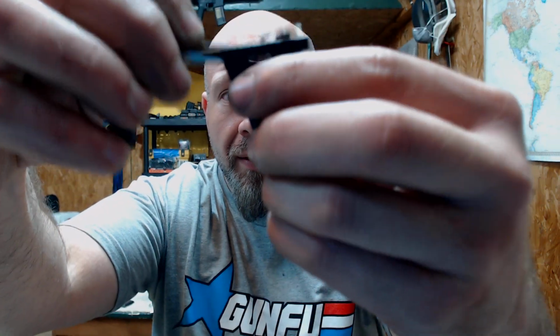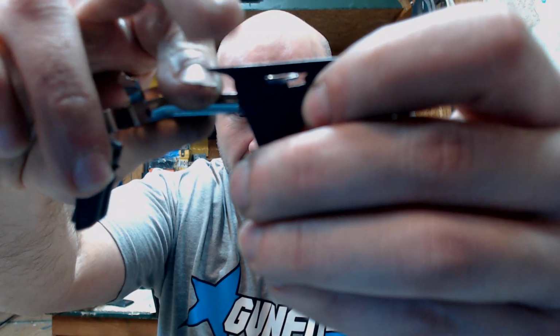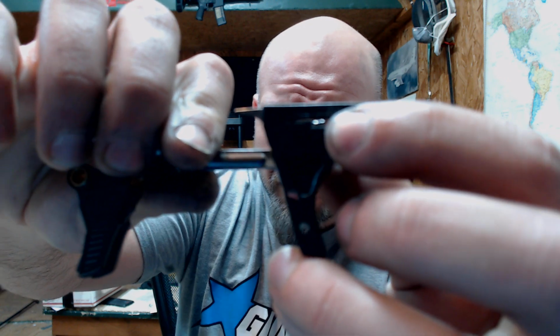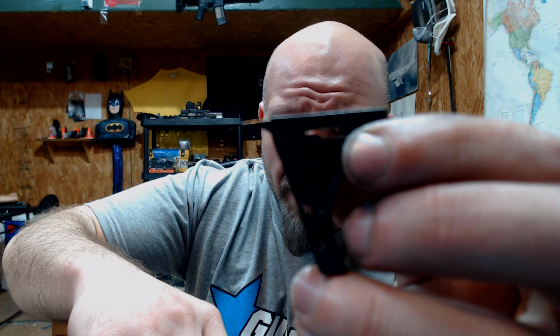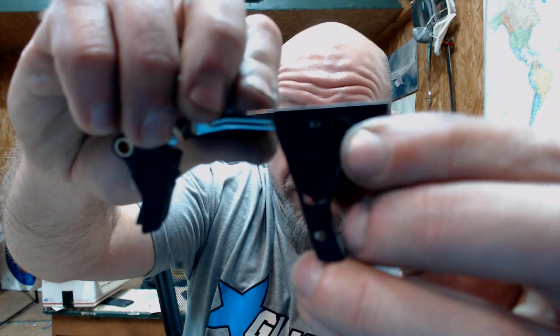So it's right there up against the wall, and it still has that safety engaged for the trigger safety. Now, if you know anything about the Glock model of operation, you should know that when you are right up against that wall, you do come into another safety issue. Now, the way that the Glock operates, here's the housing and the cruciform. It rides up on this ledge. Let's take it out of there so we can see it. See how there's a drop off?